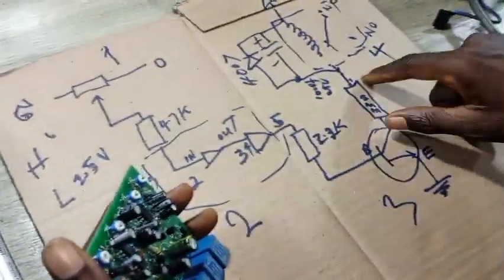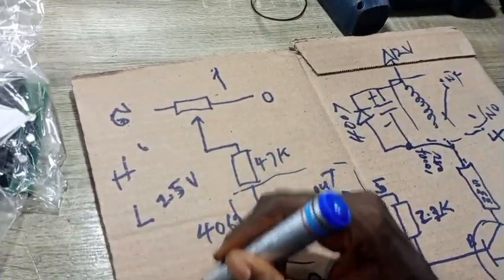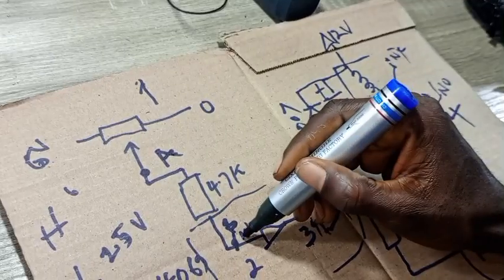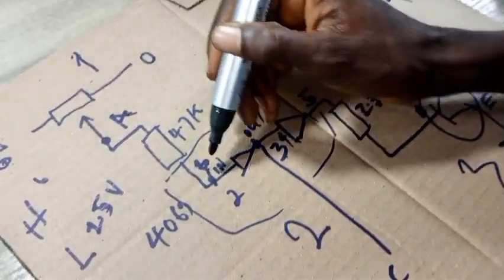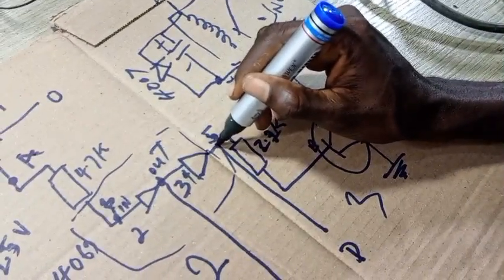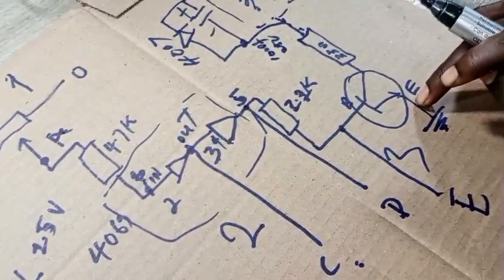So if you vary this thing and you don't hear a clicking sound, you have to check your voltage line to ground — put one of your probes at ground. Then the red probe: put it at point A here and measure the voltage. If it's okay, you measure at point B, whether the voltage is almost the same. Then come to point C to see whether if you feed in like 3 volts here, whether here will be zero. If it's zero, meaning it works well. Point D should be high. From point D, this high comes into point E. If all these are okay and the transistor does not trigger, you know something is wrong — just change the transistor.